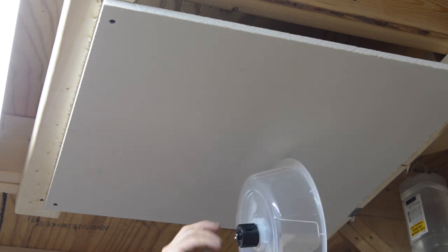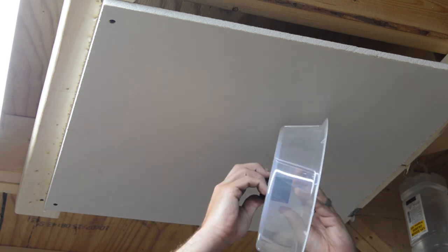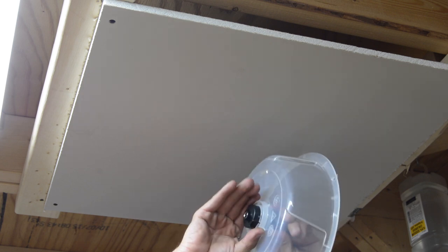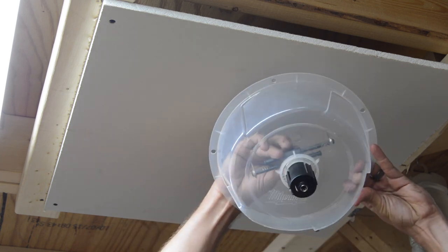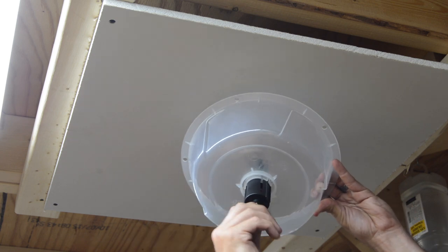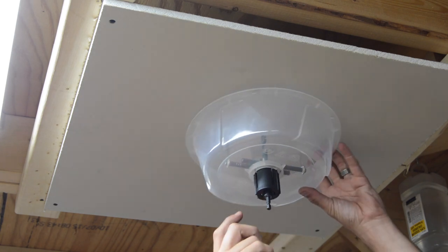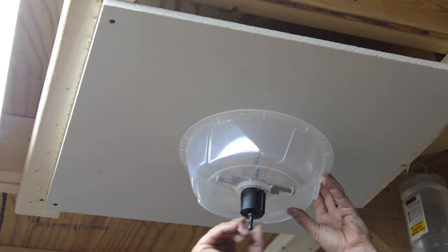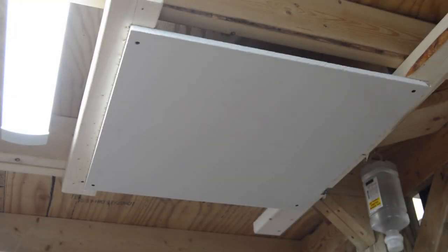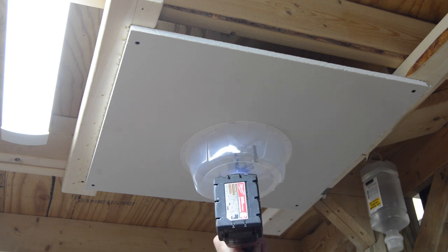You slide this accessory up into the debris shield so you can utilize the slide function of this plastic collar. Drop your hole cutter down into the sleeve — it's nice and clear so you can see the tool cutter spinning. Chuck up your drill; the instructions say it's best to use it on high speed. Let's put a mark on the drywall and cut a hole overhead.